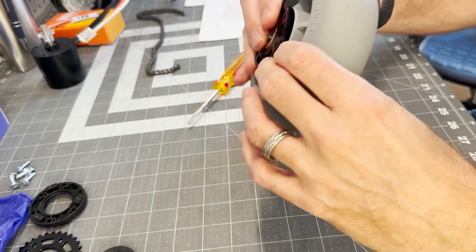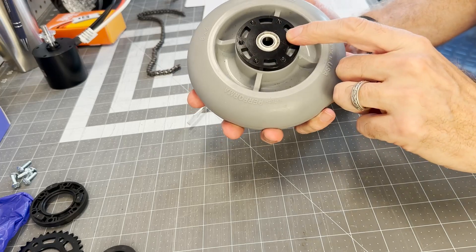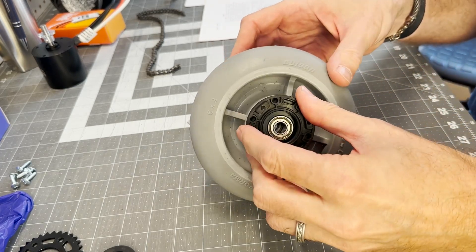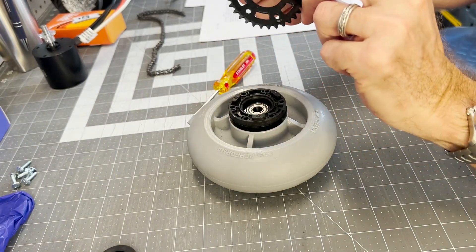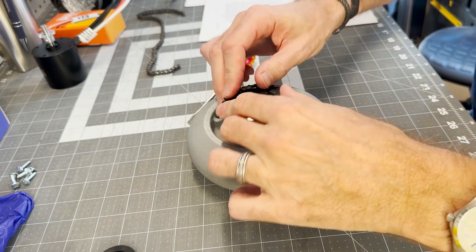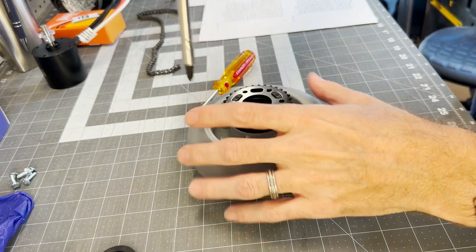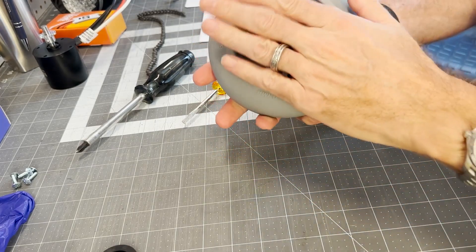This dead hub doesn't go all the way through — it's actually made to accommodate two different wheels, but it will work just great for this. Once you've got the dead hub in place, you can get from Colson or from Vex what they call a versa hub. It's got these little nubs on it which mate up to the holes on the dead hub, and you can press it in place. You can also get from Vex this 32-tooth gear which fits over these nubs. Then you screw it in place and now you've got a wheel with a gear on it — this can now be a drive wheel.